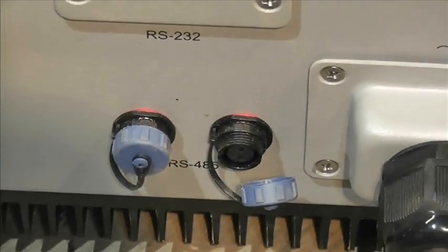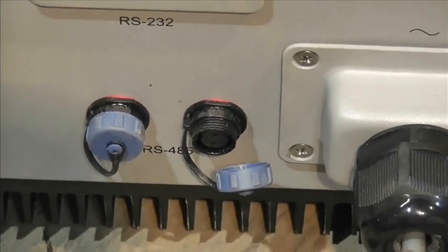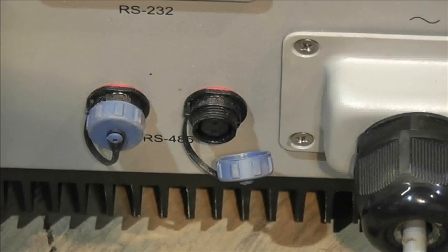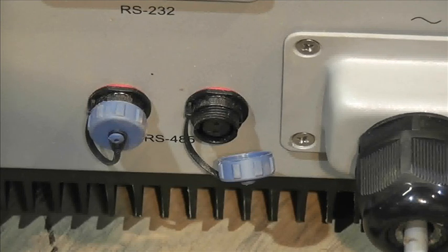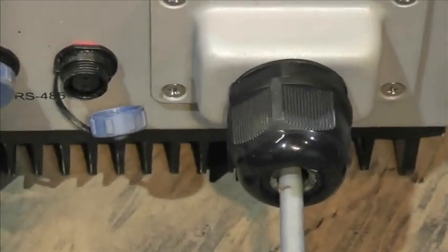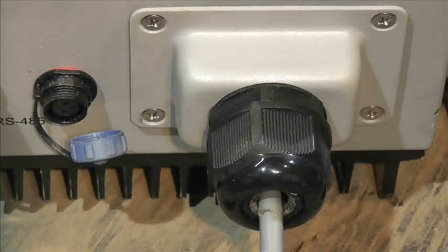The main thing is there are no buttons on the front, so it's purely tapping, but the menus don't have a great deal to change, which is useful — unlike some of the others like the Auroras where you can do all sorts of things. This is just a standard 3.6 kilowatt inverter. Really heavy front cover — see how thick that is, solid aluminium — and a big heat sink on the bottom. If you ran it at half capacity or just over in a cool place it's not going to give you any grief for a long long time.